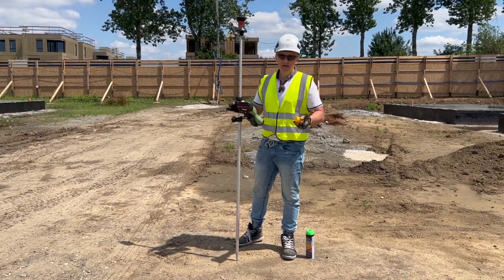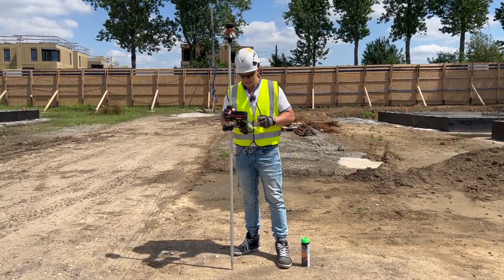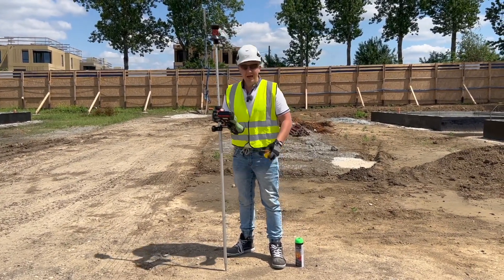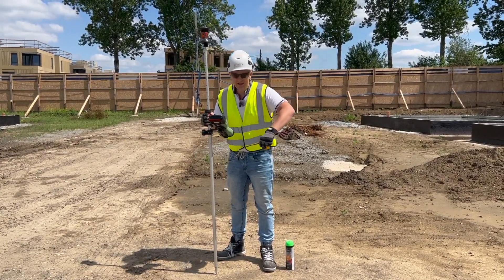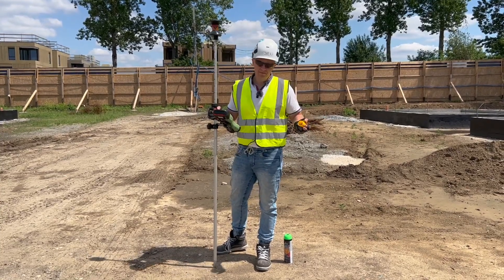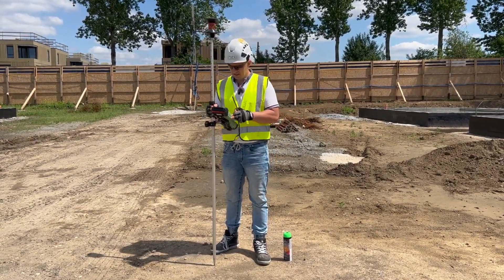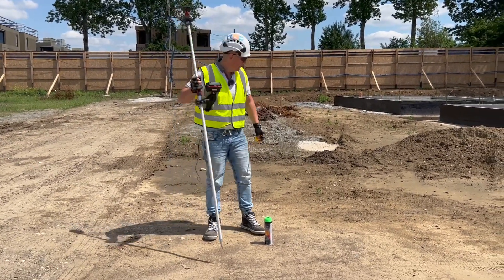I'm on the point now perfectly. When marking piles, some people will tell you there's a big tolerance on them, but we want to set it as perfect as we can — exactly at the spot. When the rig comes they're never going to go perfect, so the tolerance is only for them. For us there's no tolerance, and it doesn't take much extra time to do it right.